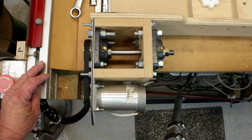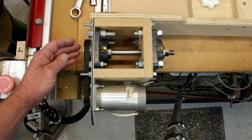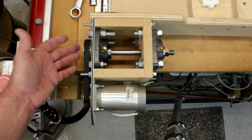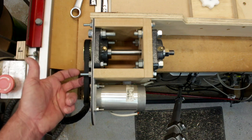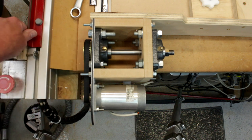The new ratio won't reduce my speed by a great deal — I'll still have plenty of speed available. I also didn't realize at the time that this belt is not the right one for these pulleys — this is a metric belt and these are imperial pulleys, so they don't mesh very well. But they mesh well enough to do some testing, and the testing is showing very promising. I've ordered the correct belt and pulleys, which are direct replacements — they should arrive sometime late January or early February.